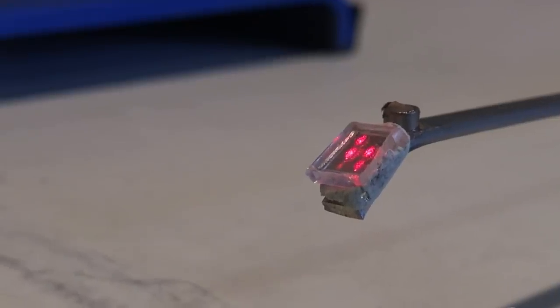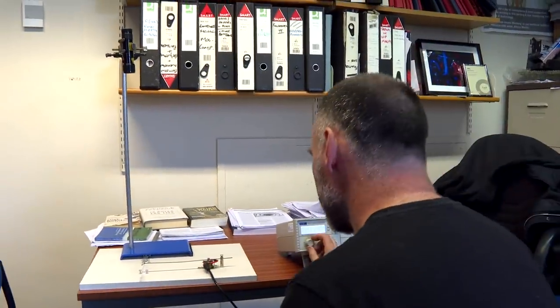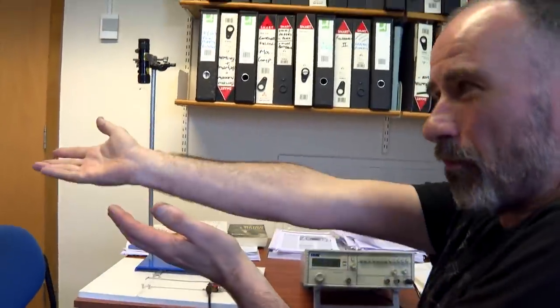At the moment you can see it's bobbing up and down, but not very much. We're at 4.4 hertz. So what I'm going to do is turn the frequency up — notice I'm not changing the driving amplitude, all I'm changing is the frequency, and this is really important. It's going up — 12 hertz, 14 hertz, 15 hertz — we're getting some response but not much. 16, 17, 18 hertz — a little bit more, but not much still. That's not much more than when we were at 4 hertz. That's off resonance — we haven't hit the natural frequency yet.